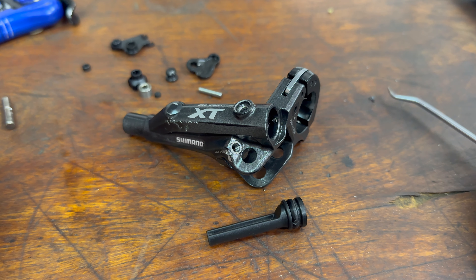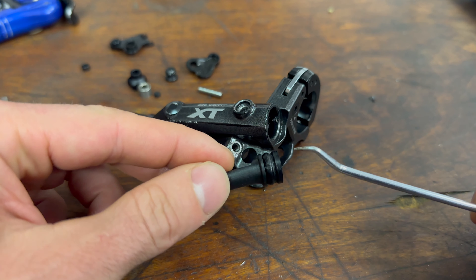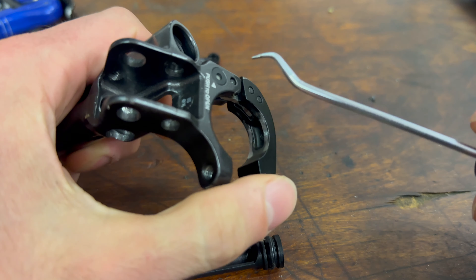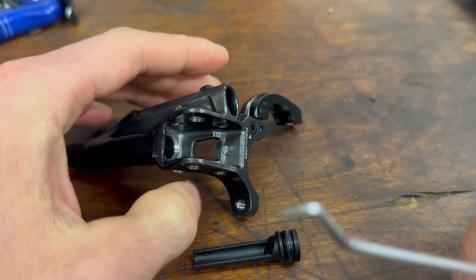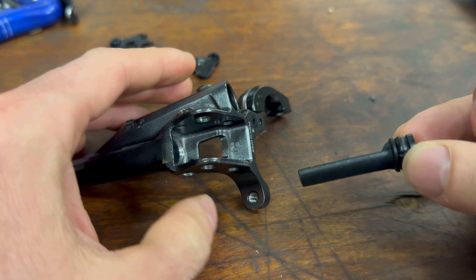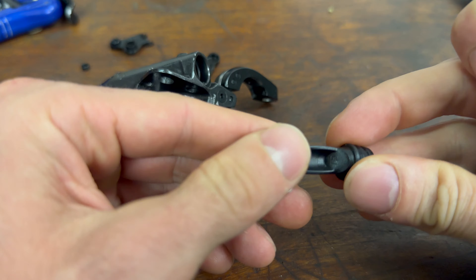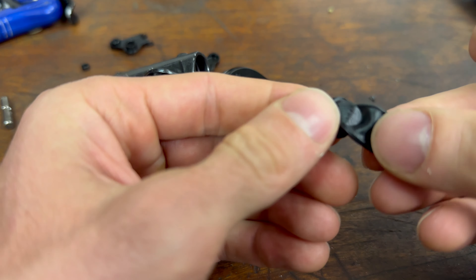Later I took some time to inspect why I was unable to pull out the cover with the diaphragm. You see this groove — it's caused by this screw which is being screwed in from the inside of the clamp, from this side. So I was unable to see it, and this is how I damaged it while pulling it out. So if you are replacing the diaphragm, you first need to unscrew it and then you can pull this one out. And also — I found the hole.